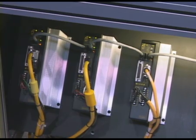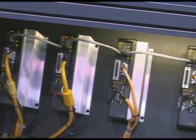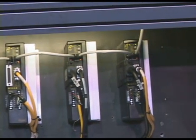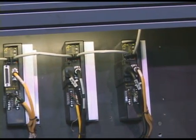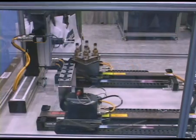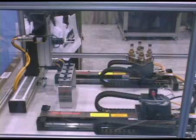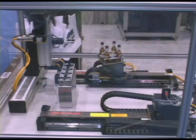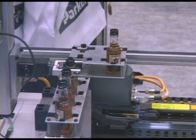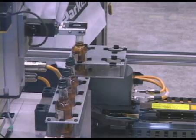These are the Aries Ethernet Powerlink motion bus servo drives, and you can see that they are connected again by an Ethernet cable back to our 9040 multi-axis controller. Up top here you can see the actual servo drives and motors at work. We have both linear motors and rotary motors, as well as some ball screw mechanics that are doing the motion shown here in the demo.